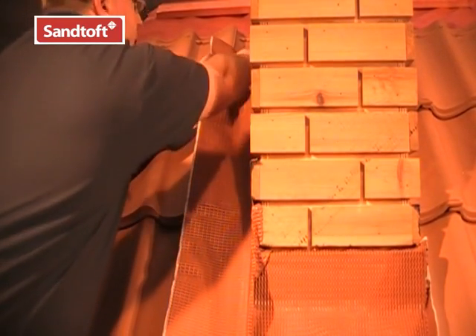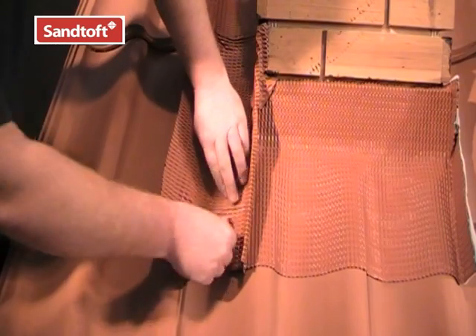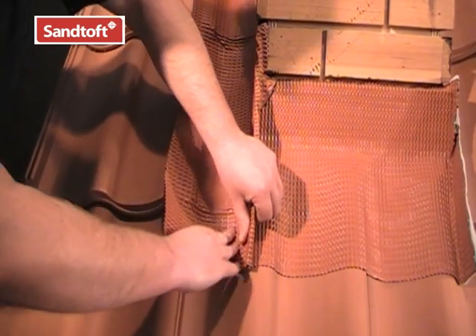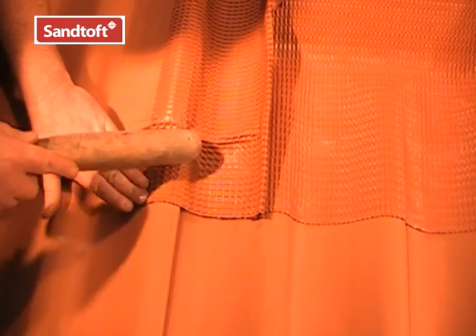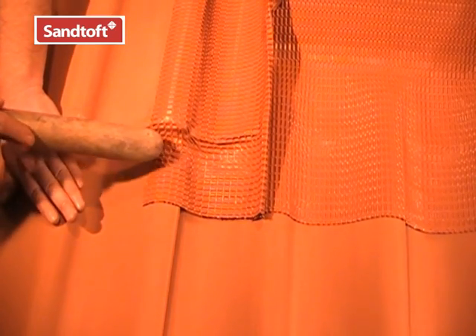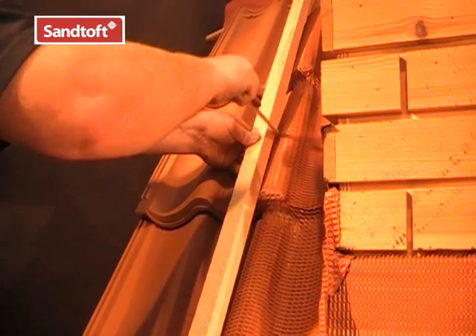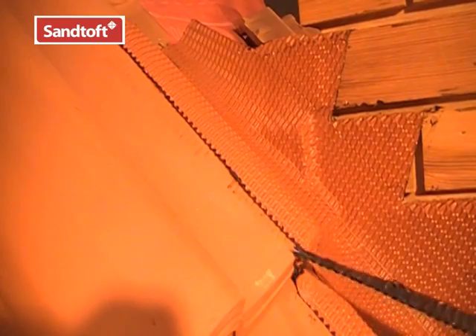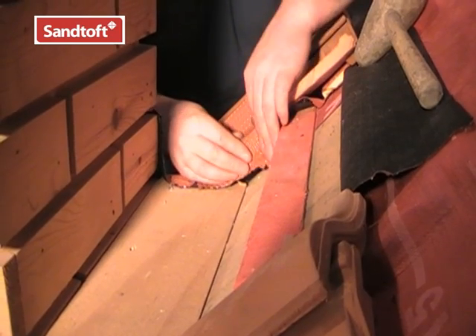Next we are ready to dress the cover flashing over the tiles. We peel off the backing paper and then start pressing the flashing onto the tiles. Take care to push the flashing right into the corners over the tile tails. A bossing stick comes in really handy for dressing the Coraflex, but you can also use non-specialist tools such as the shaft of a hammer or even a knife handle. If necessary, the outer edge of the flashing can be marked and then trimmed to a straight line to give a neater finish. At the top end of the side flashing, trim off the excess, leaving enough to allow a turn over the back gutter.